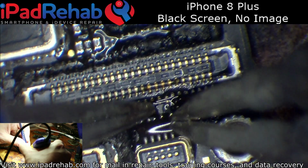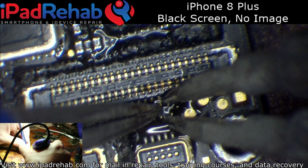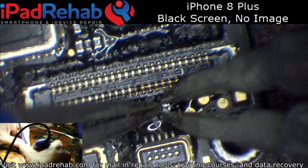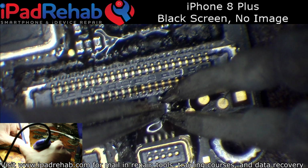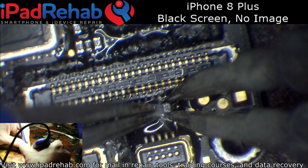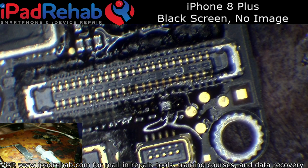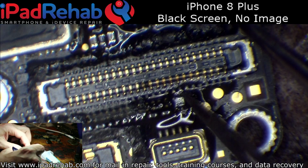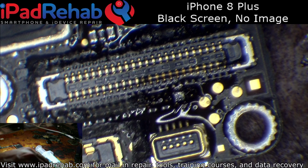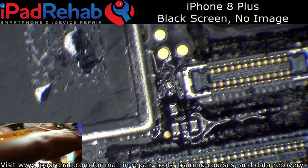And for practical applications, you can pretty much just swap any choke for any other choke. And in a pinch, you could even put just a jumper where a choke was, two jumpers where the choke was. I always replace it just because if you've got any donor board on hand, then you've got at least 8 or 12 of these chokes, right? All the donor boards have image and camera.